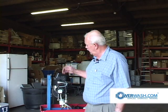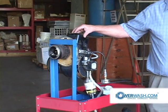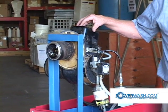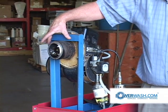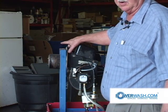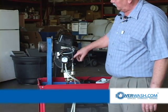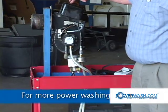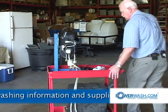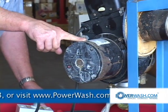This brief clip is just to show you how an oil fired burner works and some basic tests on it. What we have here is a 115 volt burner system off of a pressure washer, set up for demonstration purposes. Normally this cone would be inside of the fire chamber in your pressure washer and this plate would be bolted to the back or burner head. We have a fuel pump, fuel solenoid, burner transformer, and on this side a combustion blower motor, or blower motor for short.